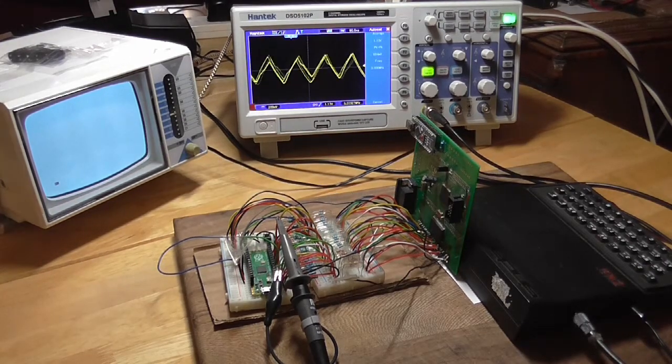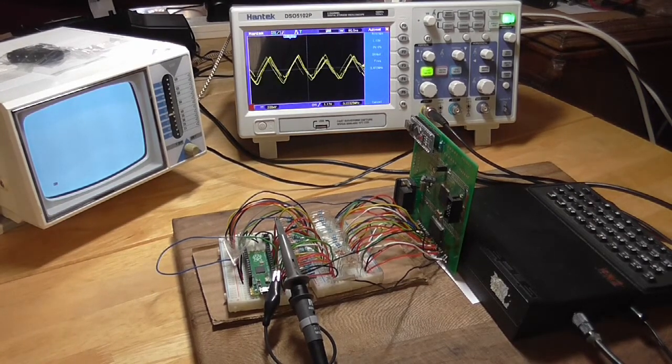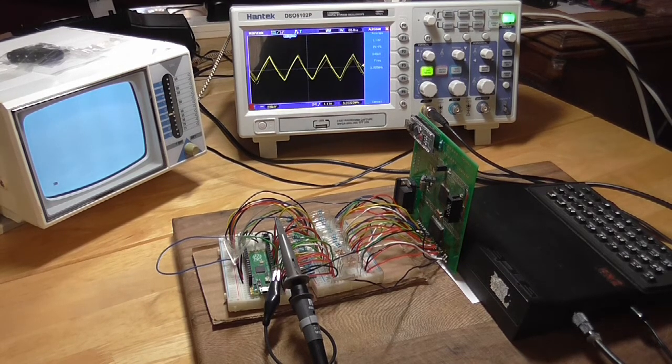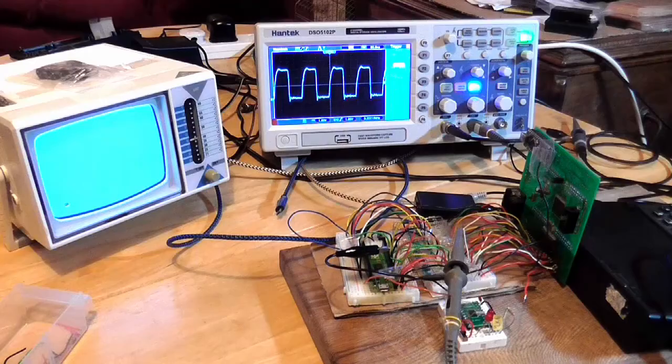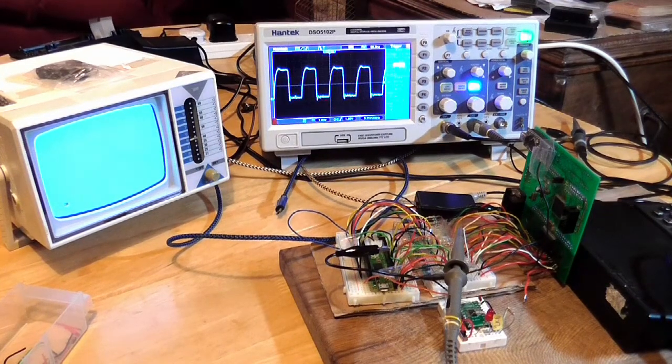So whilst I was struggling with the errors in my code, I wondered if I was having difficulties with the electronics. So I put the scope on the signal from the clock as it reaches the pico, the ZX81's clock as it reaches the pico, and got this ugly sawtooth wave. I thought this was due perhaps to the stray capacitance in the circuit, which had been shown on the microchip diagram I showed last week, which I had thought was a capacitance that you had to put in yourself, but that was an error, and is actually just showing the stray capacitance in the circuit. And I certainly will have a lot of stray capacitance in my circuit. But actually this sawtooth is just because I didn't realize I needed to put the scope on the times 10 impedance level. So once I got that sorted, it looked like this, which gives me a great deal of confidence that I can carry on just with the simple resistor divider network for now.